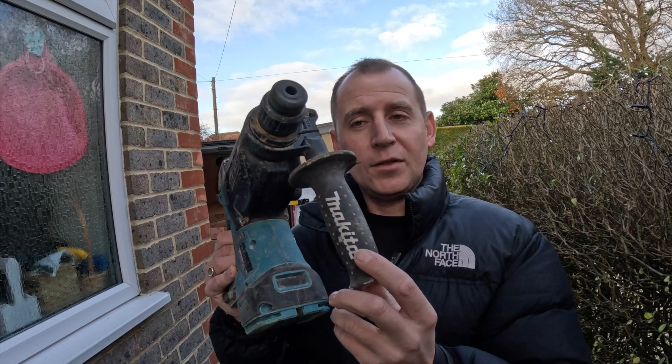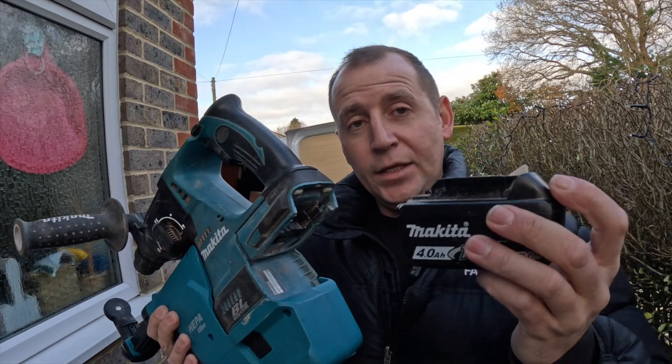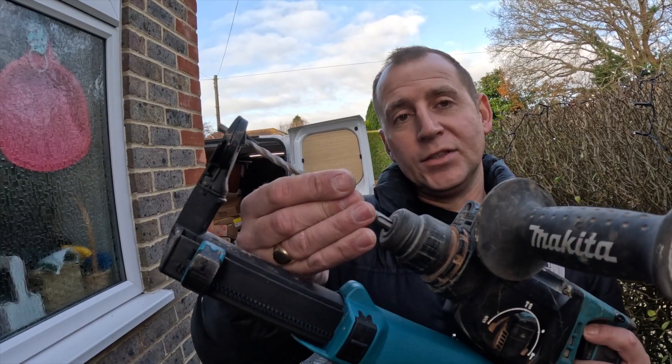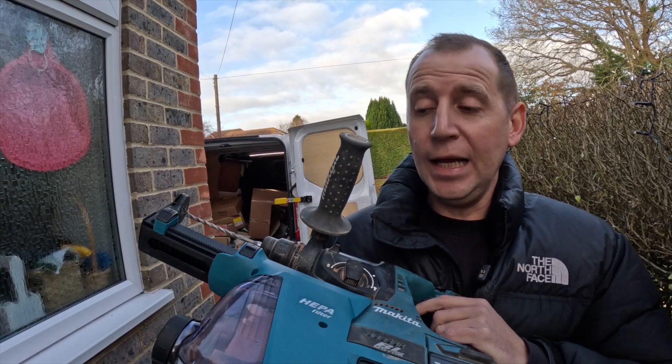If you've got a handle on it like this, loosen it and turn it 90 degrees if you want to keep it on, and then this pops into this. Put your battery in. To be honest, you could probably leave the battery in, but this is only the second time I've used this so I'm still learning. I am going to do a review on this - I want to try it on quite a few jobs first. It costs about 90 quid, so potentially an expensive dust collector, but I don't like sweeping up dust. Get your drill bit, pass it through that end and into the SDS, and when you pull the trigger you'll hear it kick in - it's got a HEPA filter.